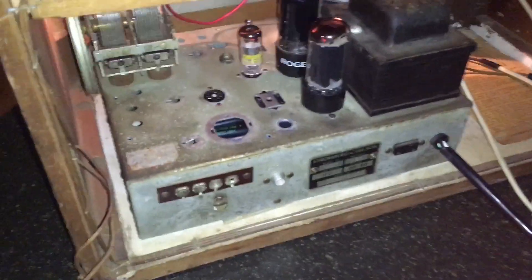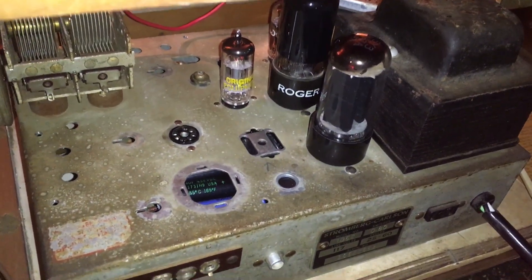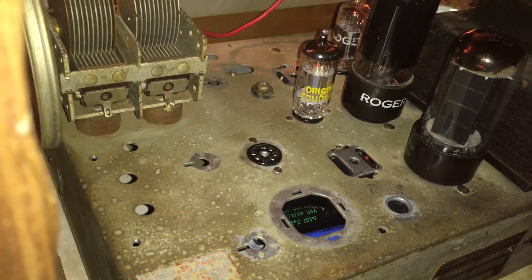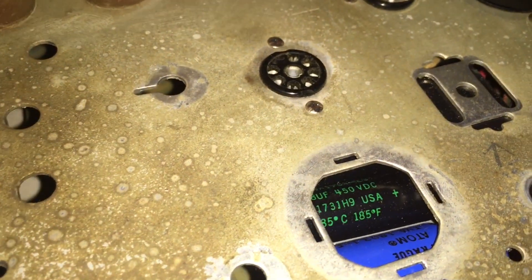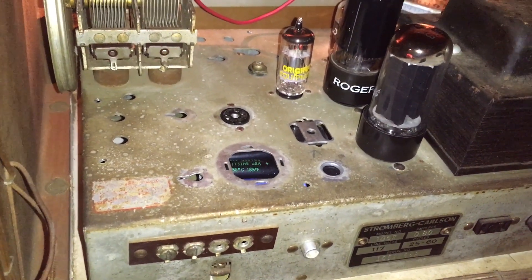Swinging around back, under the hood here, I have a nice beefy power transformer, my 5Y3 rectifier tube, my 6V6 tube, and then my two 6AV6 preamp tubes — I'm only using the triodes of those. They essentially have the same characteristics as 12AX7s, so I thought they were very suitable given my 7-pin socket situation. I have one socket available and I'm probably going to try a tube tremolo with that last tube. There's a little bit of makeshift wiring for now just to get the speaker hooked up until I put a jack on it.